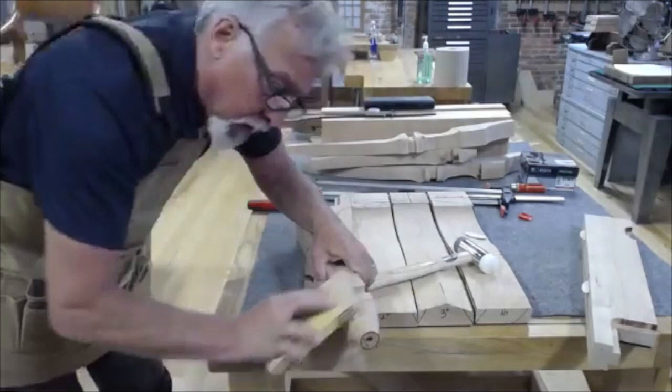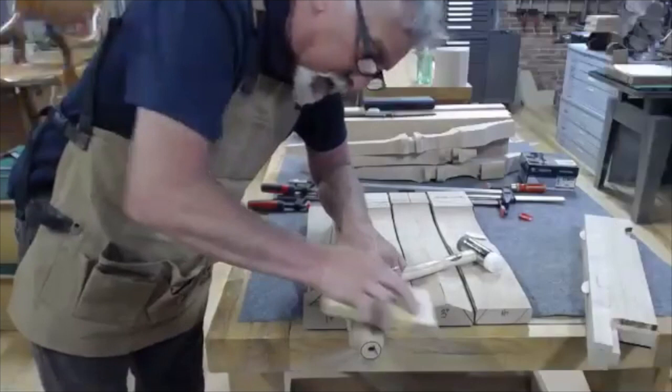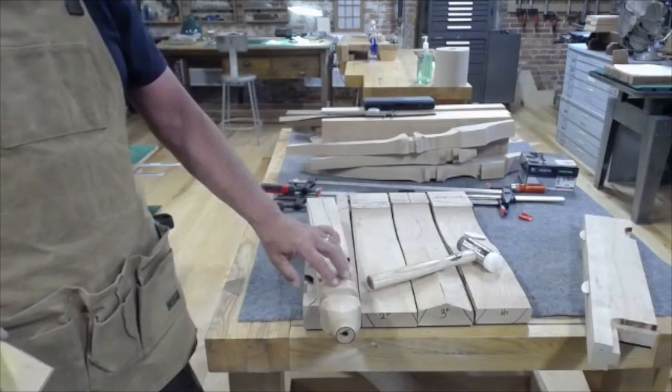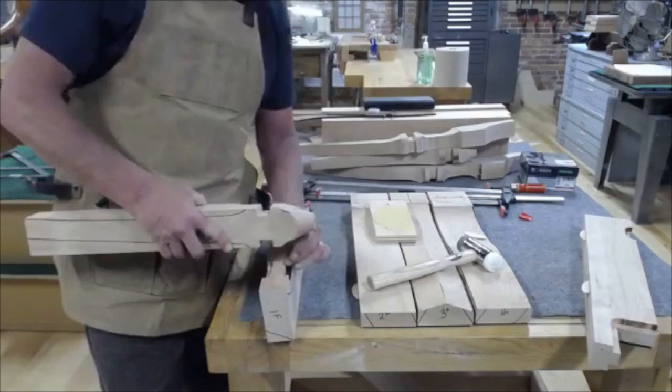But you don't want to do just one side. That's why you've got the block. You want to do both sides at the same time, the top and the bottom. If you're not getting a tight joint there, that's one method you can use. The other is that you might not have cut this deep enough. That's a hard recovery after you've rounded it over. So the way to test that before you round it over is to make sure that it will fit in there. Thoughts following that? Yep.